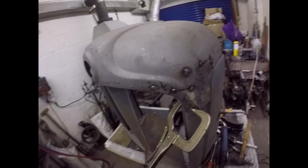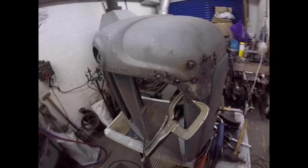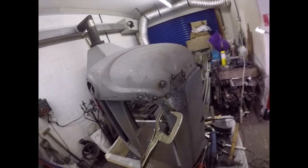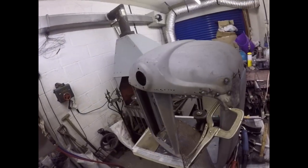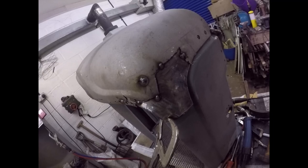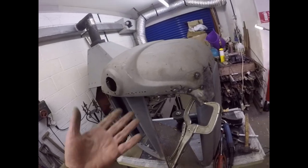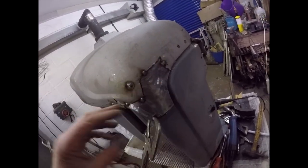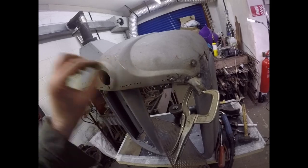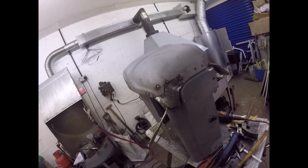For a first trial fit I don't think that's bad. We need to heat this now, soften it, let it squeeze into there, and put some more curve into it — but basically it's going to fit, I can make it look right. I've got the welder set just spot on now — it's welding much better. When you're working with thin tin and want little tiny tack welds, it's very important to get the welder set absolutely spot on so that when you pull the trigger you get an instant smooth weld.